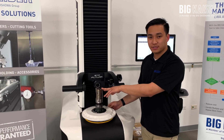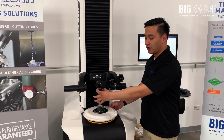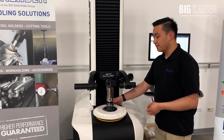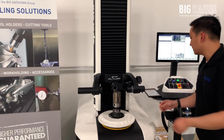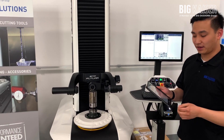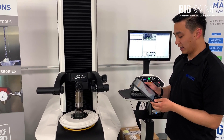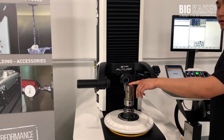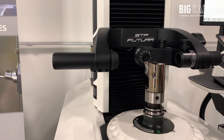There are a few motors built into this head that allow for an automatic adjustment of the insert holder for whatever diameters you need to set to. I have it connected currently to a tablet — it can be connected with your phone or tablet — and I'm going to send a command to make an adjustment. I'm doing a large adjustment, so if you want to come in close, you can probably see that this insert is moving out.